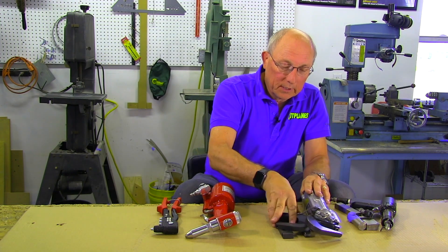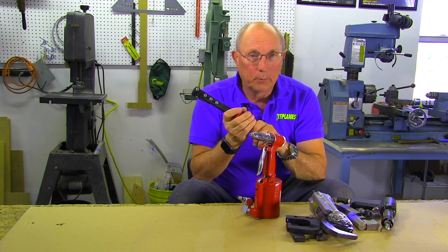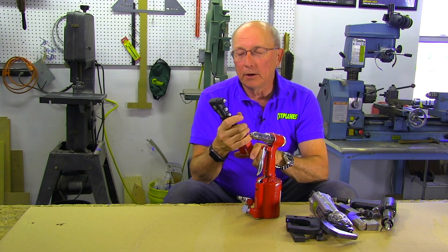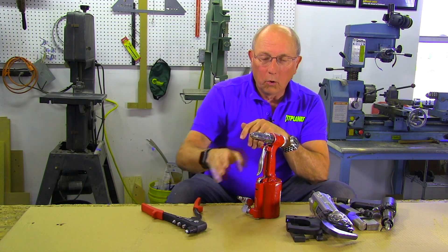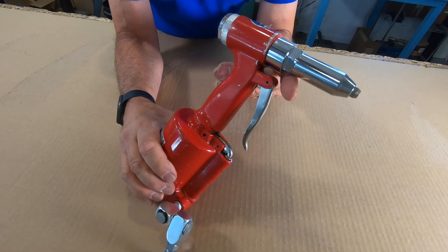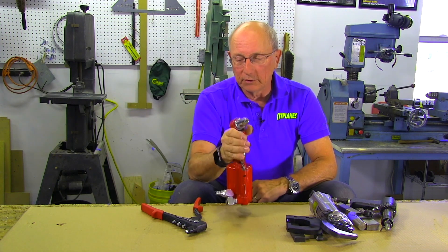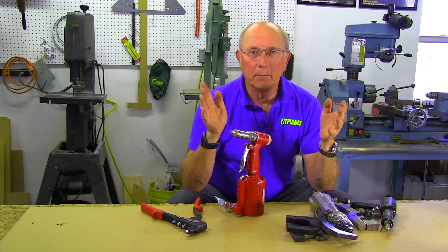The last kind of riveting you're probably going to do is pulled rivets. A lot of airplanes are built entirely with pulled rivets — we try not to use the term pop rivet, as that has the connotation of hardware store rivets. Pulled rivets are generally done with a hand riveting tool where you squeeze it, or if you're building a whole airplane of pulled rivets you'll want a pneumatic puller. Pull the trigger, hook it up to your airline, and you'll get a really good rivet set. Those are some of the basic tools we're going to use to build a metal airframe.